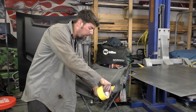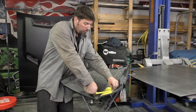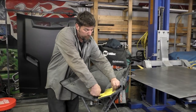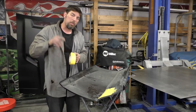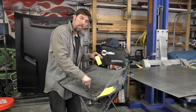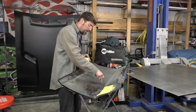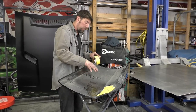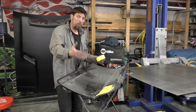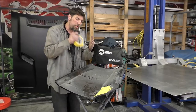The idea on TIG welding is you want the fitment to be as perfect as you can. On MIG welding you can get away with a little bit of a gap — actually a lot of times on external 18-gauge you're going to want a little bit of a gap to fill it in. With MIG welding on sheet metal you're going to sit there and as soon as you hit it you need enough heat to penetrate, but you're also warping it. Another reason we don't like to MIG weld is you're spotting different areas — spot, spot, spot — and that's putting inconsistent heat in the panel.